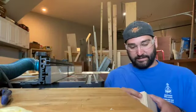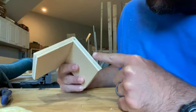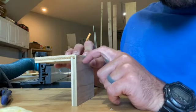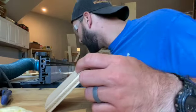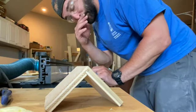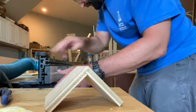With that pass you can see it corrected — the tongue is a little bit bigger, and that's pretty good. But now our fence must have moved on us, so we need to increase this by about a sixteenth of an inch. So looking at our fence, we're going to move it back to increase that component, and I'm just using those marks.